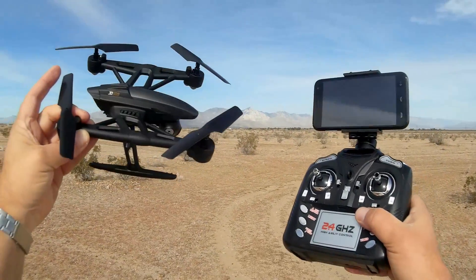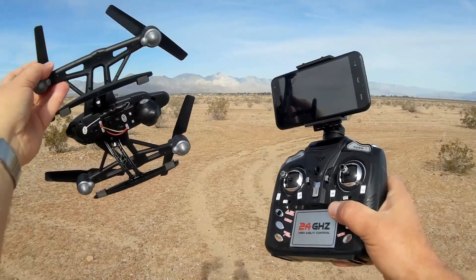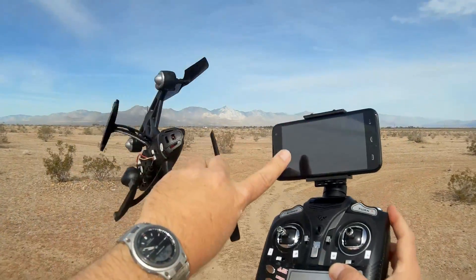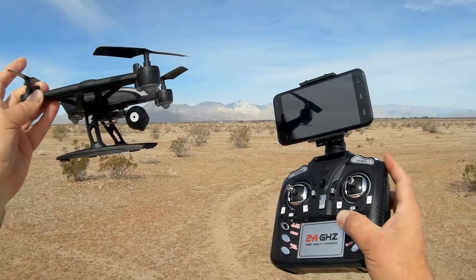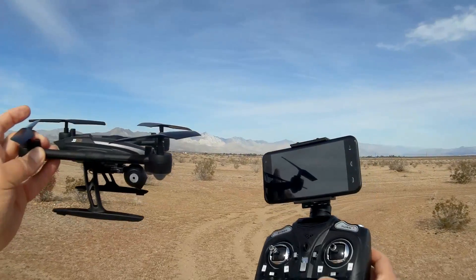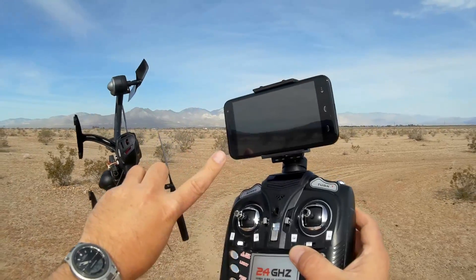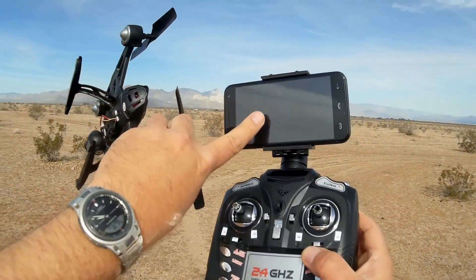Another thing to consider with Wi-Fi FPV flyers is they normally are not capable of recording in HD video, even though a lot of them are advertised as recording in 720p HD — they cannot. Usually what they do is transmit at a lower resolution to reduce the data stream that has to go to your phone and reduce lag. Sometimes I've seen 320 or 360 by 180. What I'm trying to say is they reduce the resolution of that video to enable reduction of lag. I believe this records at 640 by 480 resolution to your phone.